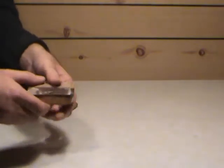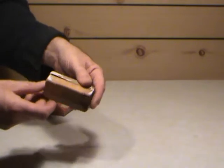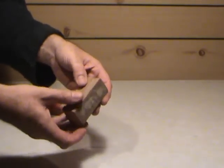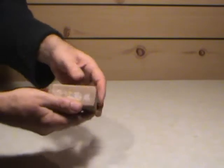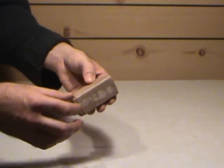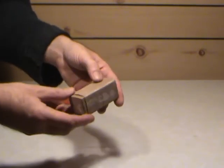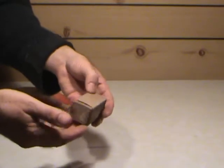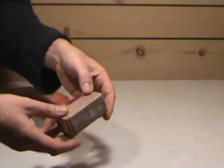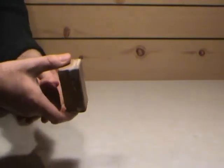If you don't have a commercial sanding block, this is just a piece of scrap lumber — I cut it to length, got a staple gun, and stapled on a piece of sandpaper. This one was for doing corner work where drywall meets the ceiling or where two walls butt up against each other. You can grab any shape of wood, staple a piece of sandpaper on it, pull it tight — and you've got a really cheap way of doing sanding work without wearing your hands out.